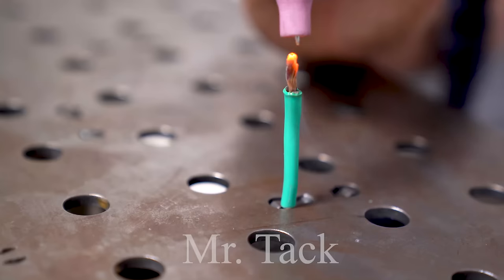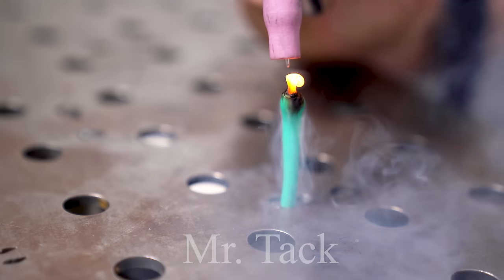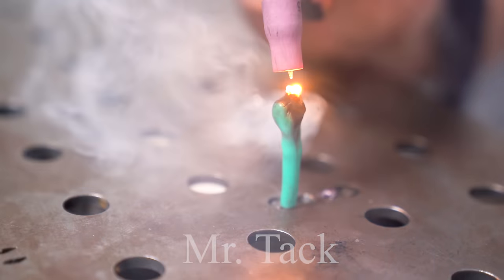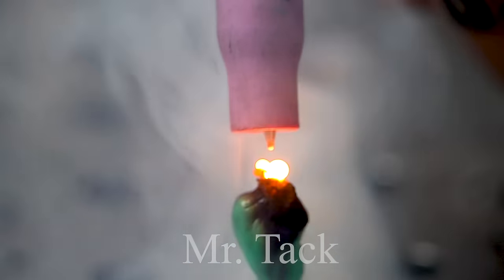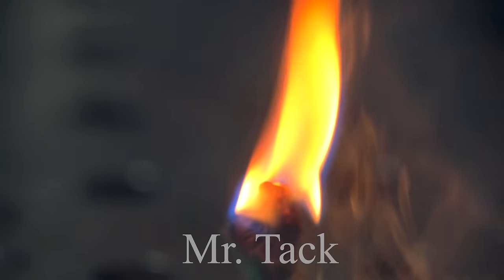But this process as a whole, this cold welding, is not really what it's cracked up to be, because at the end of the day, the result is a weld that is cold or not structurally sound. So that's not really a good thing. I do see it useful for tacking up small parts, maybe even the spring kits for exhaust components and stuff like that. But that's also, again, nothing that a regular TIG weld couldn't do. So why would you spend extra money just for tack welding?